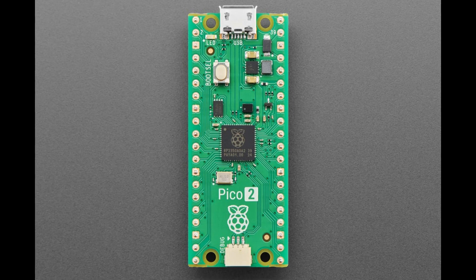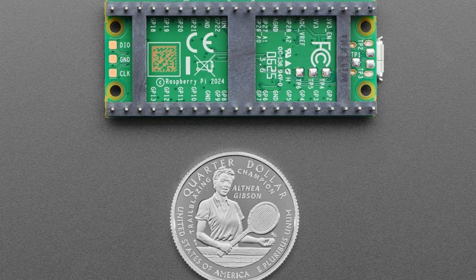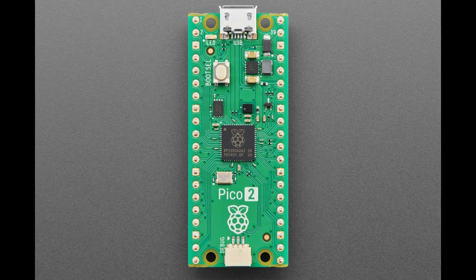It's got nice strong pins — plug into sockets or headers. A lot of our boards already have sockets on them, so it's super easy to get started. The Pico 2 has so many things going for it over the original Pico: twice as much RAM, twice as much flash, about four times the speed overall, Cortex-M33 cores with a floating point unit, and it runs CircuitPython beautifully. All good stuff!